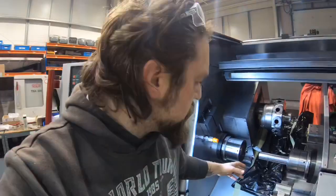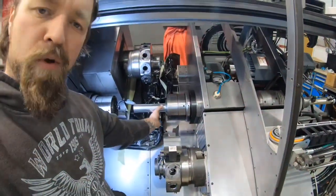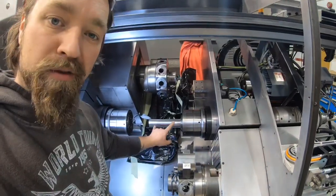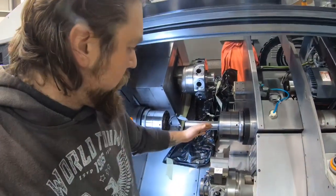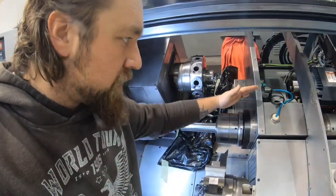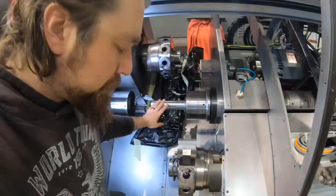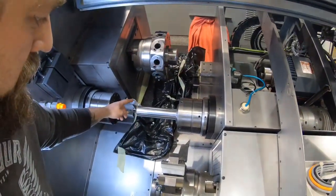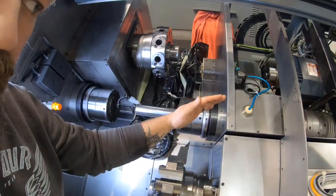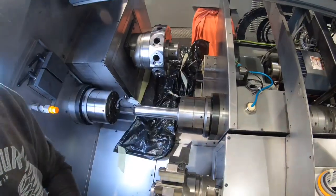So we've done the first turn test. We're actually bigger on diameter on this end, smaller on diameter this end — about 12 microns over 190mm. What we need to do is tilt it down so we turn more off and square it up. As you've just seen on the clock, we're low. So we're going to have to bring it down so it's parallel and then jack it up evenly.